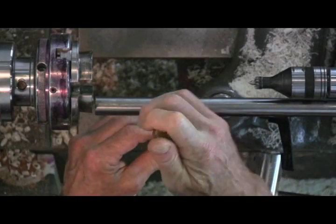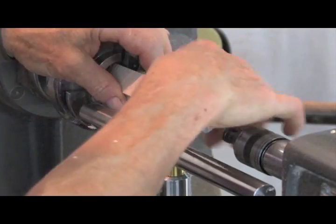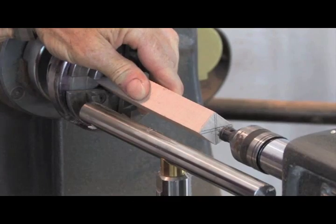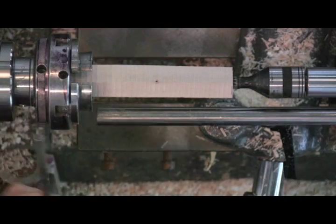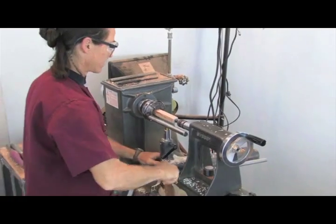It's very easy to find the center of that with an awl. The awl mark locates the tailstock point. On the headstock end, the blank is gripped between the jaw slides. That's a good way to grip a blank that's too small for the jaws in the chuck.